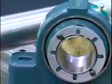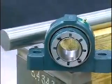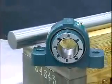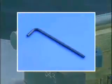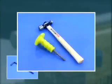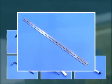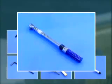We'll be mounting a 2-7/16 inch pillow block Imperial Bearing. The tools required to mount the Imperial Bearings include an Allen wrench, drift, hammer, marker, a micrometer, straight edge, and a torque wrench to tighten the base bolts once the bearing is mounted.